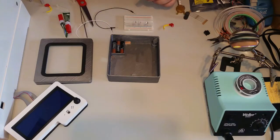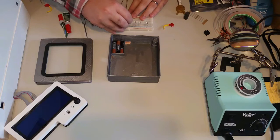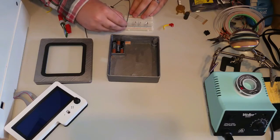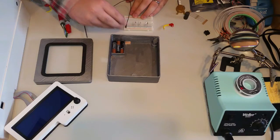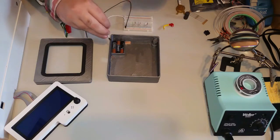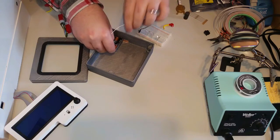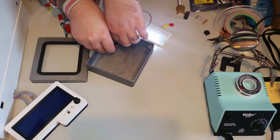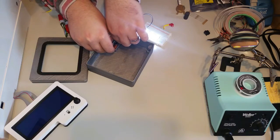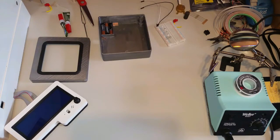That's basically our circuit — we just need to connect it to power and ground, so it's a very easy project electronics-wise. I like to color code my wires: I always use black as ground and red or white as power. I've got my terminals for the power supply sticking out here. I'll just take the power and hold it on over here, and then take the ground and connect it. It looks like it actually works well — the LEDs are coming on, staying on, and not flickering at all, so I take that as a win.